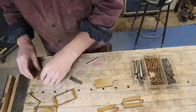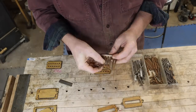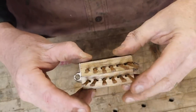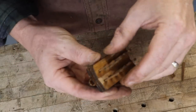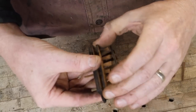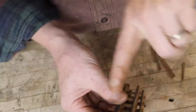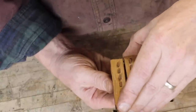I realized pretty quickly that I also need to put holes in the piece that holds the magnet in place so the nails go through past the magnet to make sure they're making good contact. The holes were a little loose. Basically, the assembly has holes going down through the bobbin, and the nails have to touch the magnet down below. One coil is wound in one direction, the other in the opposite, because the magnet poles are north and south — opposite each other — and then you put it all together and you have the humbucker pickup.